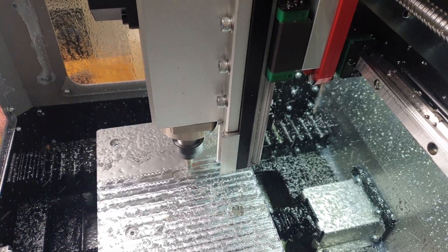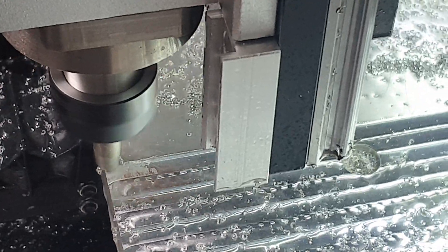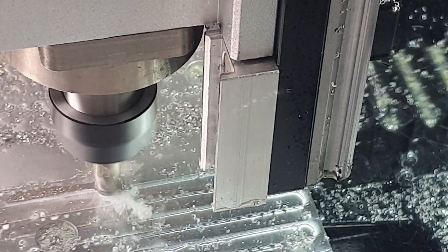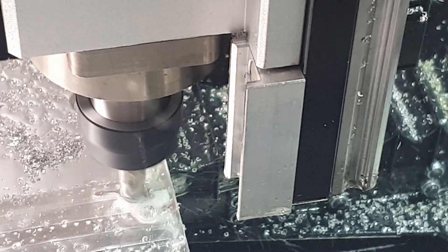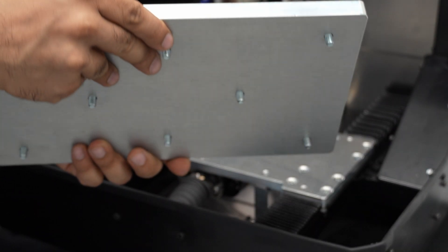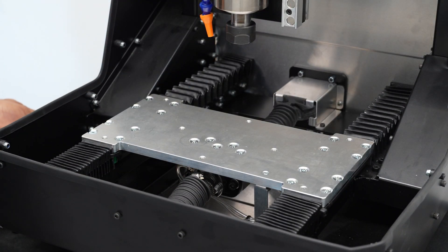The idea behind this is that you machine the top surface down to create a perfectly parallel plane after the first time you install it, and then you machine any additional mounting holes for your vice or other fixtures. As you consume this surface over time, or if you want different fixture plates to swap on and off, you can buy more of these bed pieces from us or just make them yourself, since it's designed to be an off-the-shelf rectangular piece of aluminum of any thickness with precise mounting hole locations that you can mill on the DMC2 Mini itself or even just a drill press.